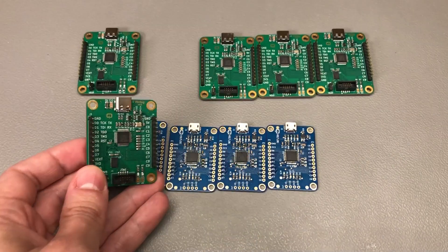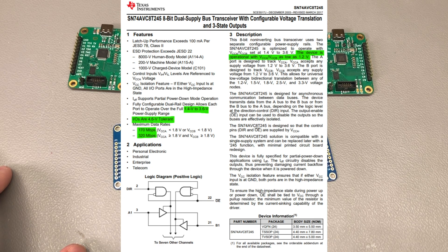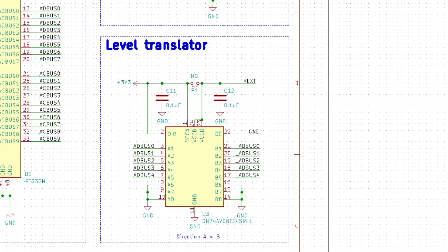The obvious solution was to add a level shifter, and I went with the 74AVC8T245. It's capable of operating between 1.4 and 3.6 volts — the datasheet hints at even lower voltages, but standard operation already covered my range. It also has quite good data rates: 170 megabits per second at 1.8 volts and below, and 320 megabits per second above 1.8 volts. Best of all, it's an 8-channel transceiver, meaning I could fit all 5 JTAG signals on a single chip, lowering cost and simplifying assembly.